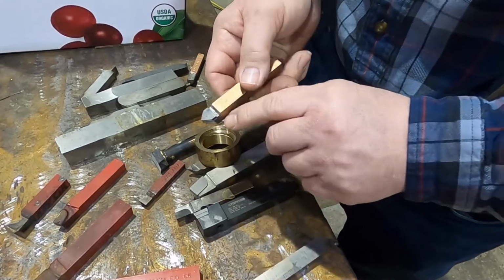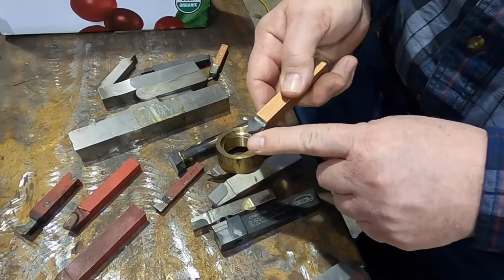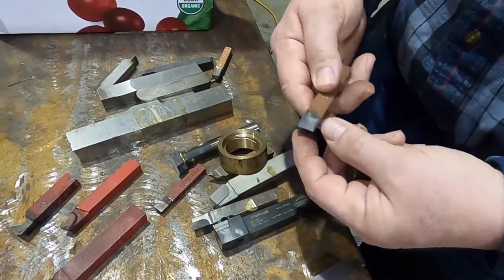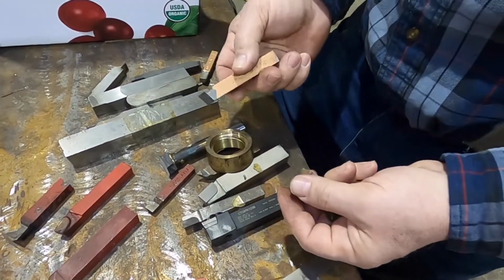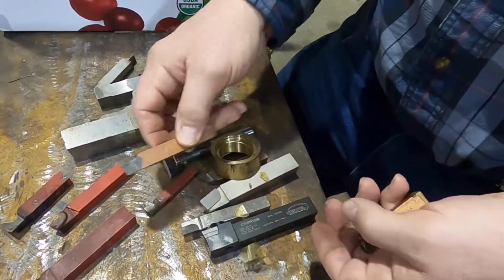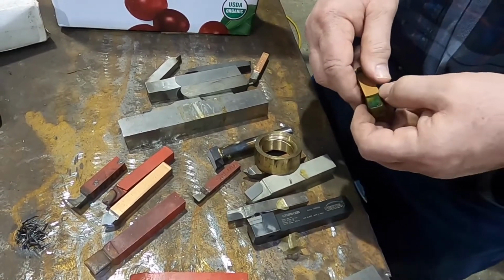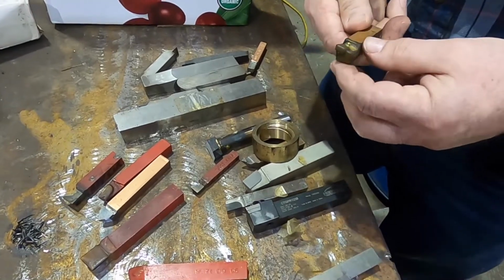I've seen many times where the water, if you're not careful, it will go down in there and actually hold next to the tool instead of staying away. Right. If, however, you have this and you keep them in an oiled environment, it will help a little bit more for holding the oil in and keeping the corrosion down. Yeah. It's not a guarantee against corrosion, though, as you see it more on the solid steel tools that it's dipped on, where there's a problem more so than with the carbide.